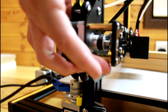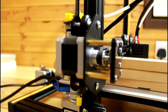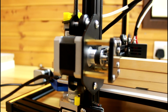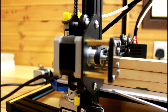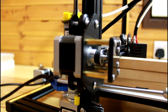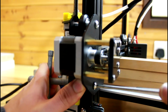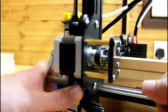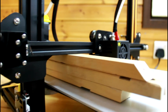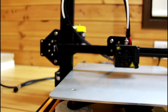and this time I'm gonna get my wooden blocks and bring them on the left side of the printer, move it back down. Once it's down, I'm gonna push a bit on the right side, so I make sure it's nice and down. What I'm gonna do is repeat the tightening process on the bottom screw. Once again, I'm gonna hold the nut, push the wheel inwards, and tighten it as best I can. So, if all went well, let's remove the blocks, move it back here.